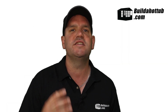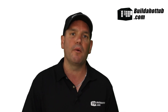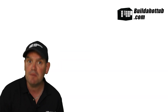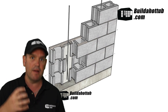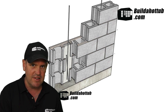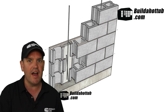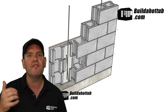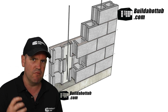Next option: CMU blocks. CMU blocks are the hollow concrete blocks and they're ideal for DIY hot tub wall construction because not only are they cheap, but you can also fill them with rebar and then pour your concrete in to give you additional strength. You've got a hollow block with that metal rebar rod tying everything together, using rebar every couple of bricks so that they're all perfectly tied together, and then you fill it full of concrete for a really strong structure.